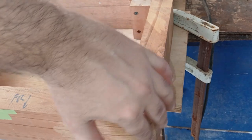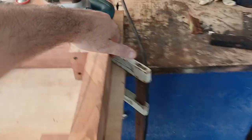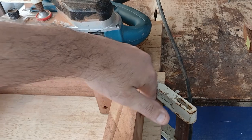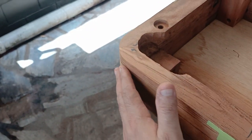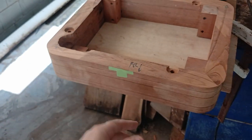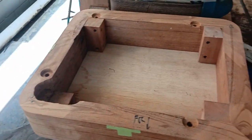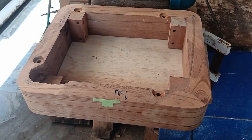I'm just rubbing my hands on it. It feels perfectly smooth. Remember, the human hands are so sensitive in woodwork. It's very useful to just feel what you're doing to help pick up on any flaws. But it feels good. Of course, I have to do finish sanding, but the initial belt sanding seems good, right? Let's move on to the routing. Going through this very quickly today.